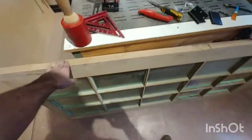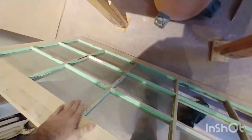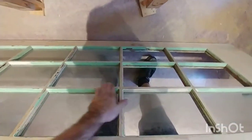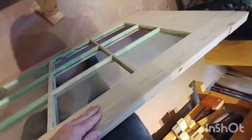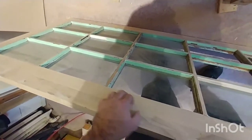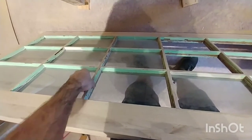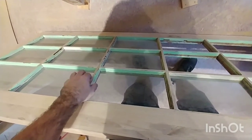Well, we came home from Braun Millwork and had a pretty good base to start building back to what we want to have in the doorway in the end here. We've got things down to clean wood all around, square, 32 inches wide, 80 inches long. Had these pieces been nicer looking and had the goal been to have a naturally finished wood door, we might have taken all the glass out and could have sandblasted or sanded the muntins and the grid. This is how you do that, by the way.